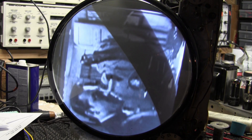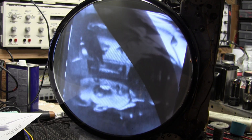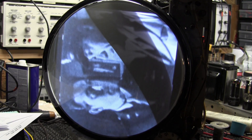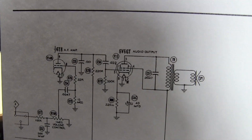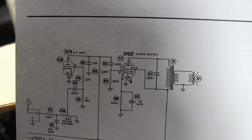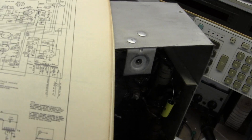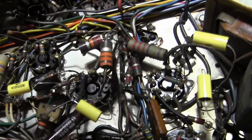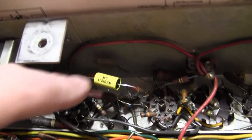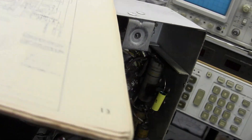Just a little bit of work — not too bad. I hooked up a video signal to the external modulation input on the VG91. Now let's go after sound. What I thought would be the most obvious place to start is the grid coupling cap to the 6V6, which is a 0.022 on this schematic — they show it as a 0.01. What I wasn't expecting is when I looked underneath the chassis, it's actually a ceramic disc cap. It's really hard to get at, so I figure that's probably okay. Let's go back a little bit further.